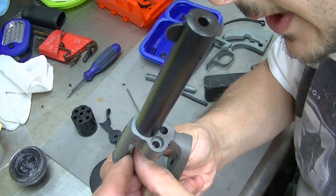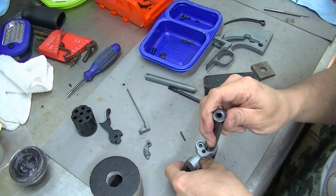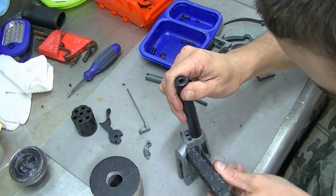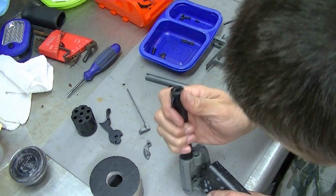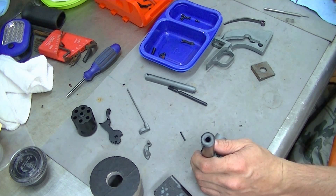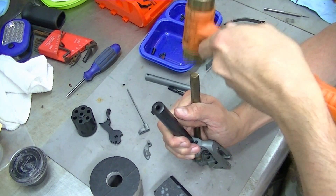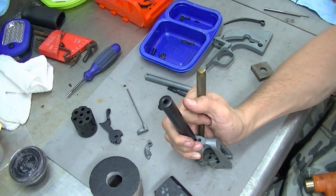This cup here will go with that notch up towards the top. As you drive this lateral pin in, it will, for the most part, be self-aligning because it will make that line up. Tap here with the brass punch and we're in.